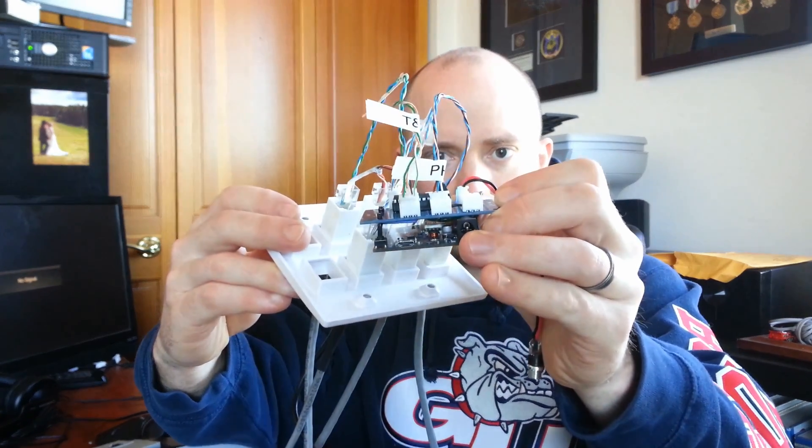Got rid of the cables — the old cables that used to connect everything. I had lots of cables everywhere running around connecting to everything, and I really didn't like that setup. Now with the new setup it connects directly to the board, so that got rid of two sets of cables. What I'm finding is that it's actually the crimper tool and the RJ45 connectors that are now the root cause of the remaining bugs. I have troubleshot the JST connectors and they all seem to be working correctly now. I had to learn how to use that crimper tool — I was on the wrong die setting, so I got that dialed in.